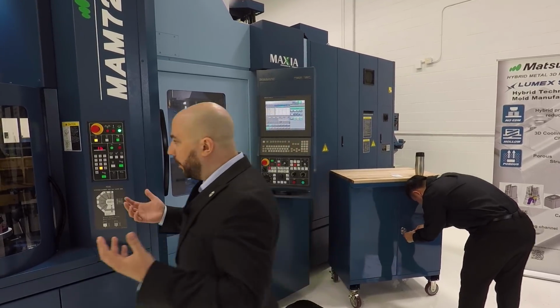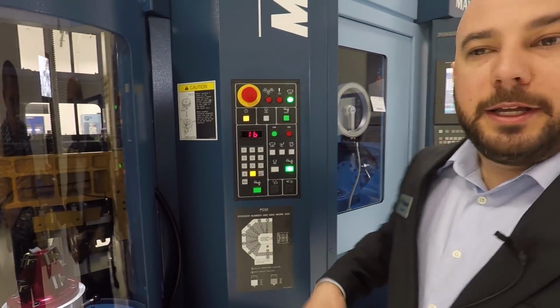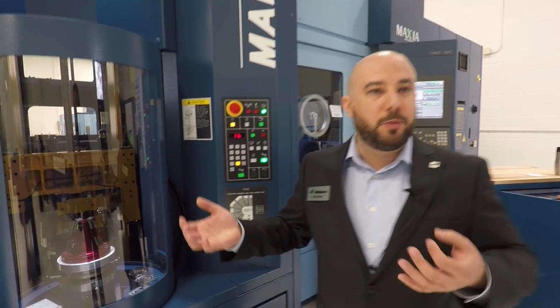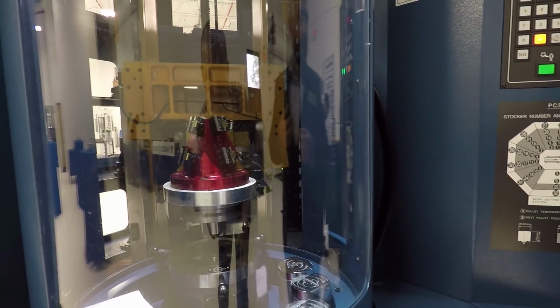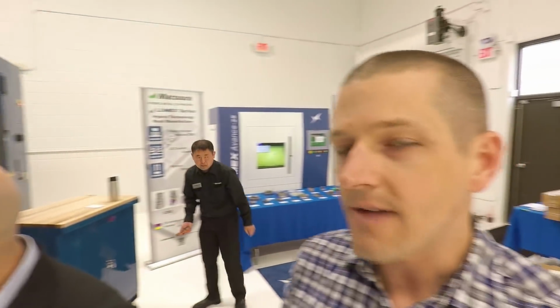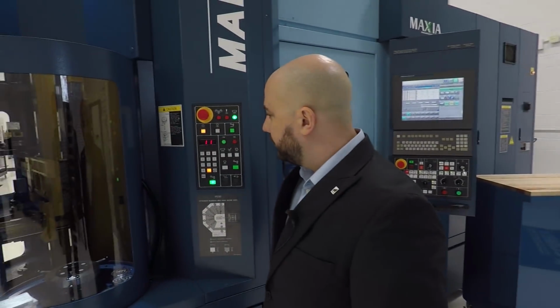Right. But again, with 5-axis machining here, oftentimes you can just get creative with your work holding to where you don't have to pull things in and out. Look at this. So let me pull this over here. And it is absolutely true, folks. It doesn't have to be simultaneous 5. It can be positional. What you just saw there was a little mini tombstone. So it could even be as simple as 3-axis work, but you want it done in a workflow that lends itself to getting to all the sides of it, or positional work, or again, leaving the machine set up. This is so cool.